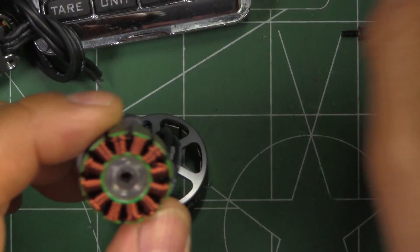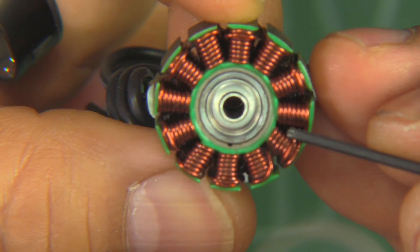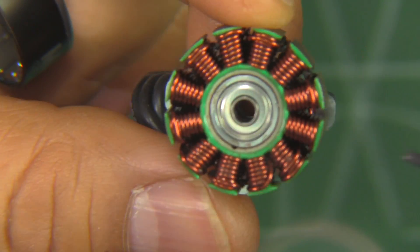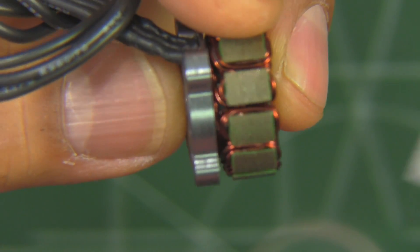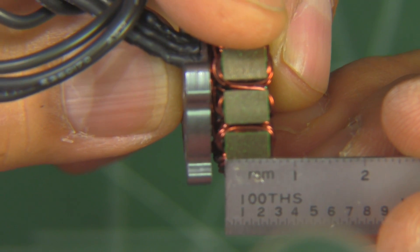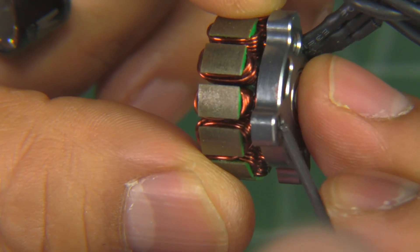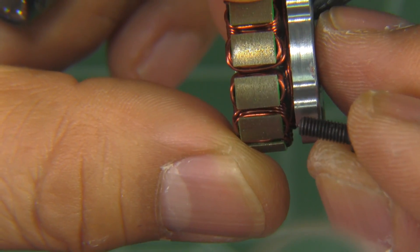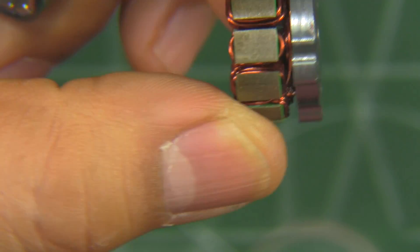Under the magnifying glass: here's the stator with pretty neat windings, single-strand wire. Those are, I believe, 3x8x3 bearings. Stator laminations look like they're 0.2 millimeters, and this stator appears to be 6mm nominal. The base is beefy — that's pretty good, should not be an issue. The only thing users need to be careful about is when threading the mounting screws — just make sure you don't go past the base, as screws that are too long could damage the windings. It's close, but there's nothing wrong with the design.